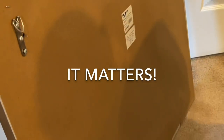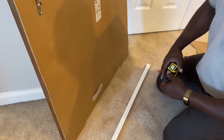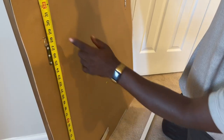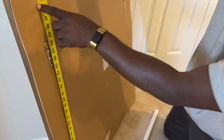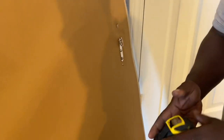However much you want to go up from your surface, measuring from the top down — I'm going to measure four inches up. I'll take the top of my nail or screw, measure to the top which is 28 and a half. If I want four inches, I'll add four to 28 and a half to get 32 and a half. That's where I'll put my screws. This one is an eighth inch short so I'll take that up to 32 and 5 eighths.